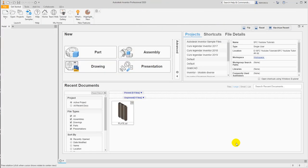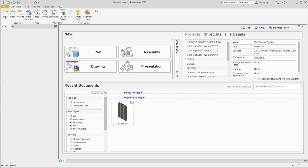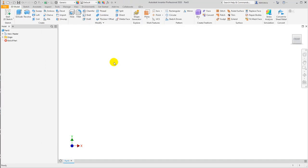Now we go to cross. You see dimensions here: a diameter of 64, and two arms of 12 and the other ones. New part, XY. It's not important where we place it in relation to the axis, but to create the part. Finish sketch. That is 10. Extrude 10, okay.